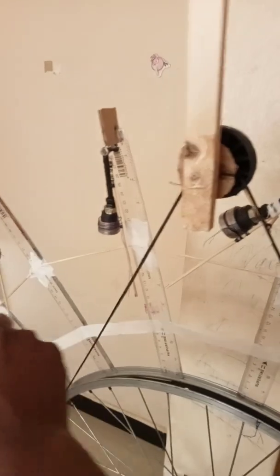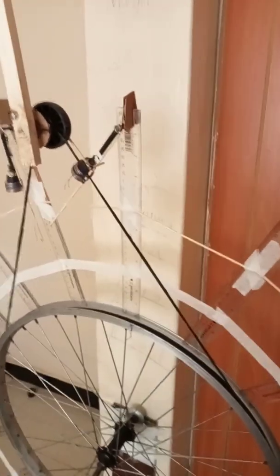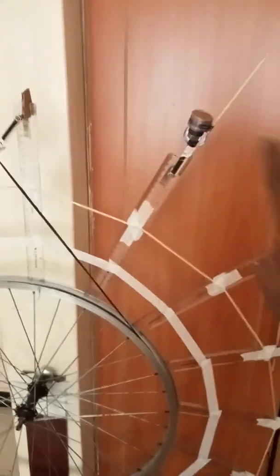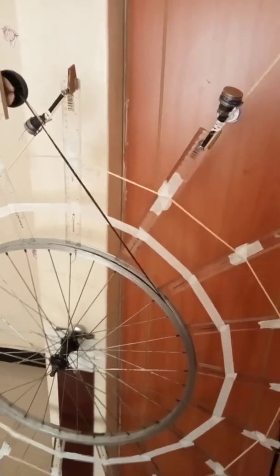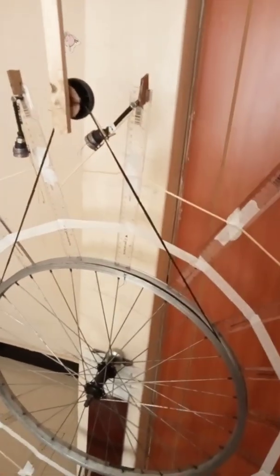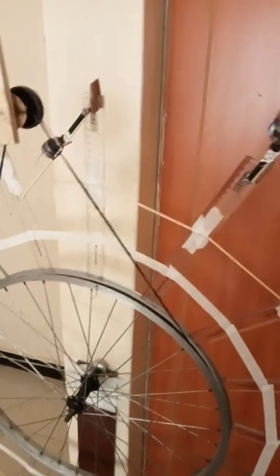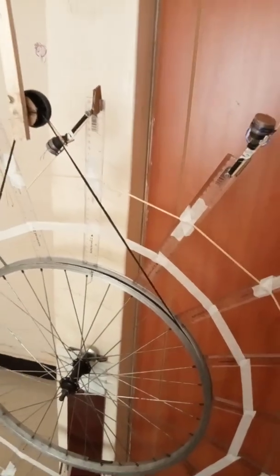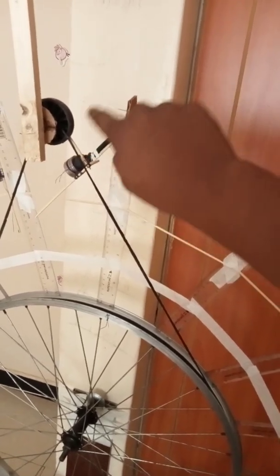And always on the left-hand side the levers will be dropping or pointing towards the ground. From the mathematical model developed from trigonometry, as you increase the number of weights around the circumference, I found out that the resultant moment increases. So if you are to use only four weights or even eight weights around the circumference, the mathematical model shows that the system will not work because the resultant moment is always lower than the energy required to lift the top weight.